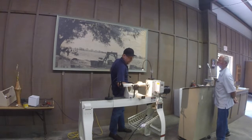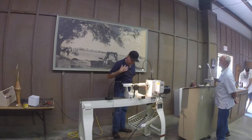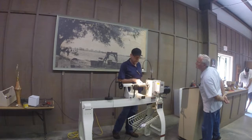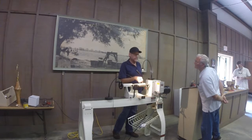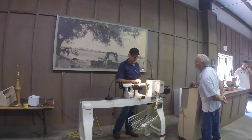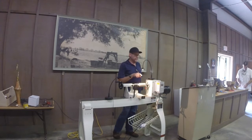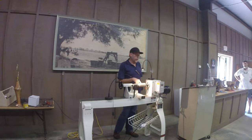And the trick to this, rather than having to turn way off a dozen times, is to watch the wood on either side and see when it turns the same, and you get that color out of it. I left the blue the way it was. It pulled a lot; there were a lot of voids in it. I like the voids, the holes and pinholes, as far as that goes. It looks more natural, like a natural material, even though it's not. You'll see there are some voids in this, and I left those on purpose to show you that you're going to have to go back and fill it two or three times sometimes. The trick with things that you're putting color in is to remember how much color you put in, because if you go back and change it, it's going to change the color. And I've done that I don't know how many times.